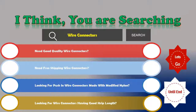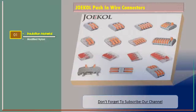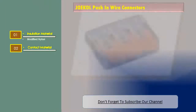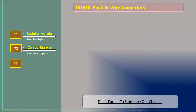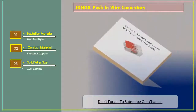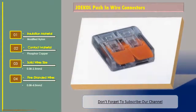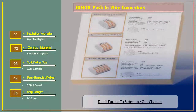We are just reviewing the top 3 best push-in wire connectors. Number 1. JoeCall push-in wire connectors, and the features are: insulation material, modified nylon. Contact material, phosphor copper. Solid wire size, 0.08 to 2.5 square millimeters. Fine stranded wires, 0.08 to 4.0 square millimeters. Strip length, 9 to 10 millimeters.